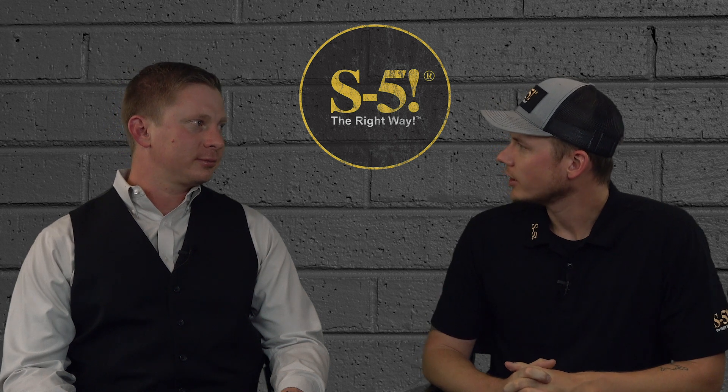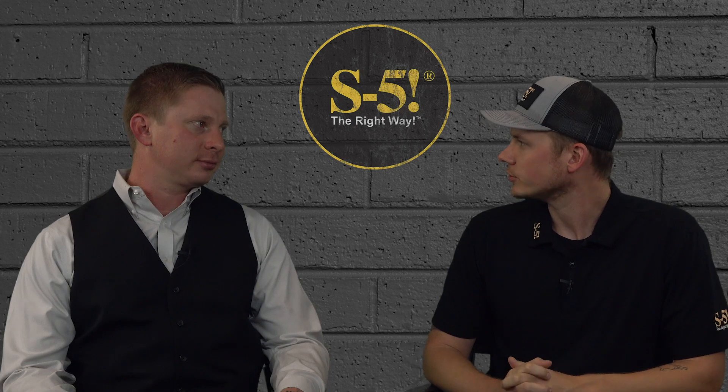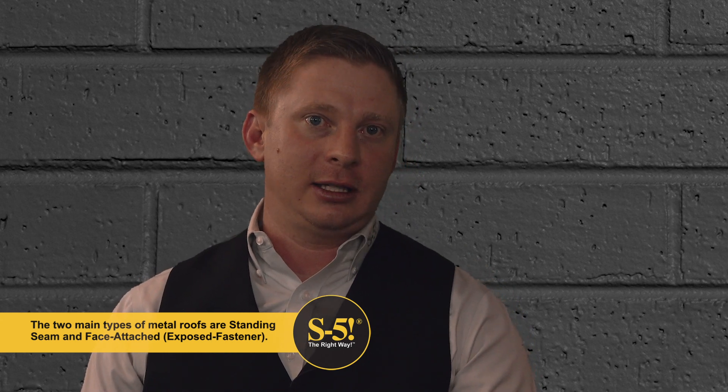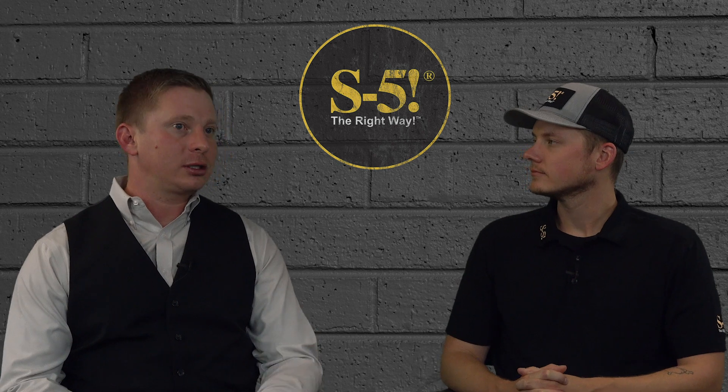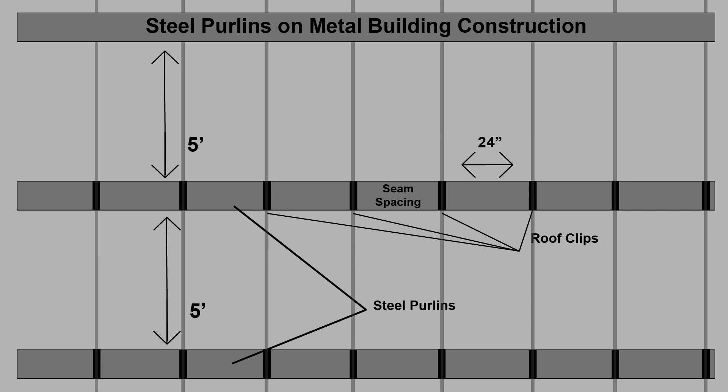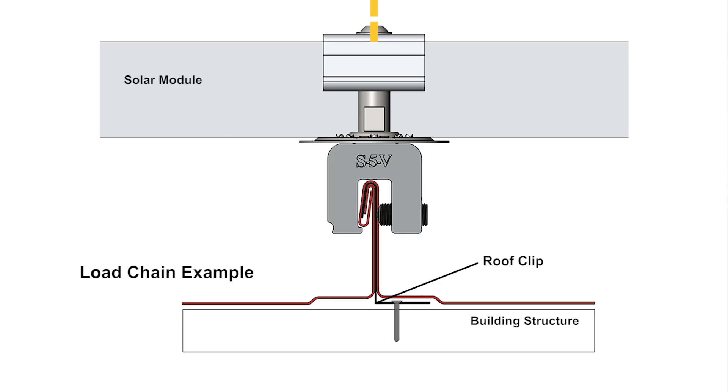Can you explain more about the load chain and how a metal roof is attached to the building structure? There are two main types of metal roofing: standing seam and face attached. A standing seam roof is attached via clips concealed beneath the roof sheathing. The clips interlock with the specific seam type and dimensioning and allow for thermal response of the roof panels. They are screwed to the building's structural deck or purlins — in residential construction generally at two-foot or closer spacings, and in typical metal building construction at each steel purlin, most often at five feet on center. Loads pass from the module through its anchorage to the rack, rail, or roof panels, then through the clips and into the substructure. Each of these components is a link in the load chain.